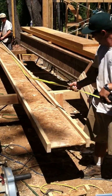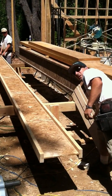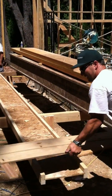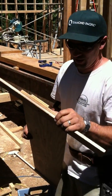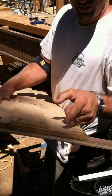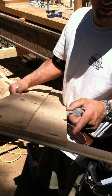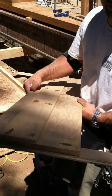There's no need to mark both sides or even draw it across with the square. These are 24 feet long, so it helps to have a helper on the other end — I've got a helper down there holding the smart end of the tape. This sled is made with a guide that's dado'd in, and the offset is equal to the blade-to-edge-of-fence distance on the beam saw. You have to be careful not to have to account for the thickness of the blade. In other words, this is set up so that I set this point right on top of my measurement mark.